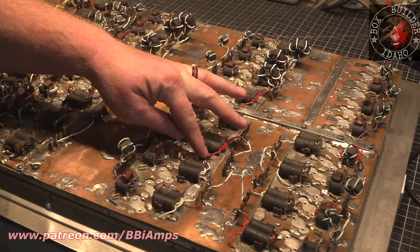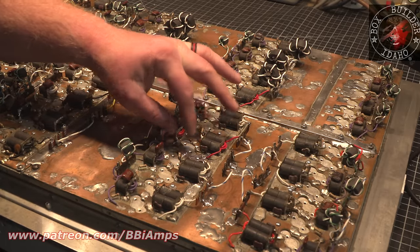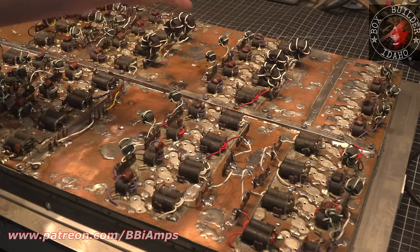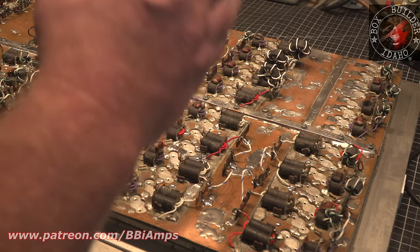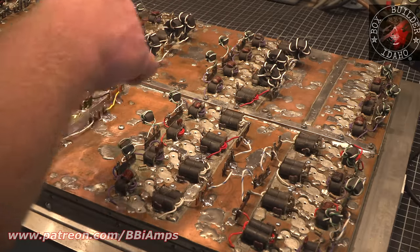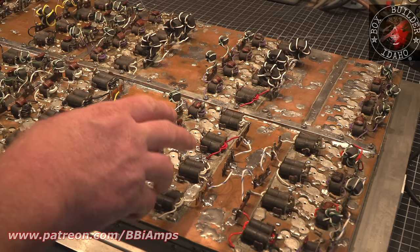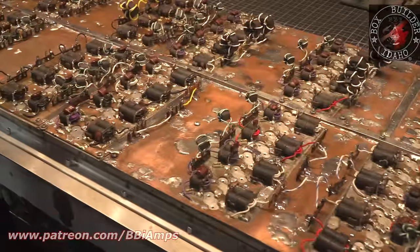This entire trace was completely missing, from here over to this corner on this transformer. I've done all the grounding that I did over here, drilling and so on. I was able to get my bit extractor down in, and I was able to get 2 of the 5 broken drill bits on this side that were in the heat sink out.